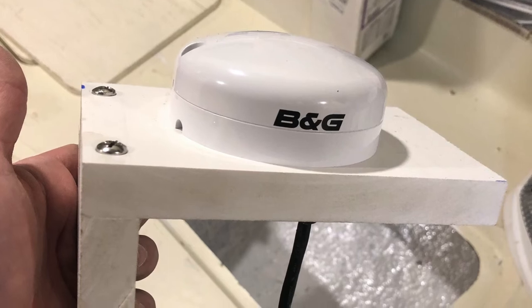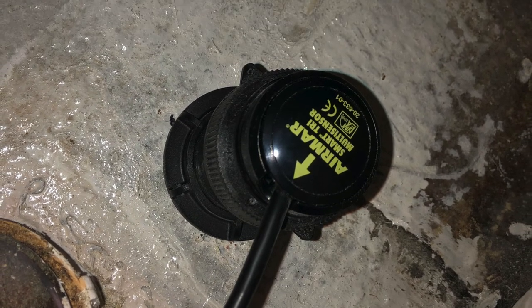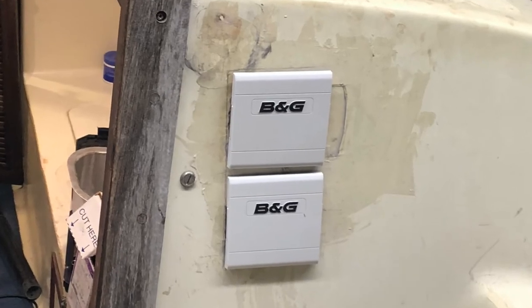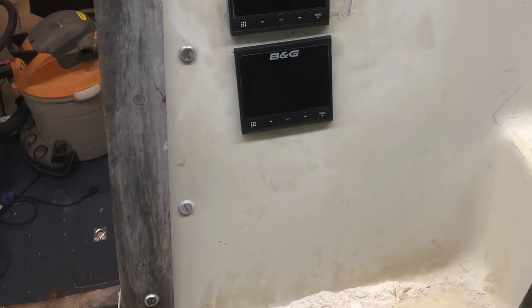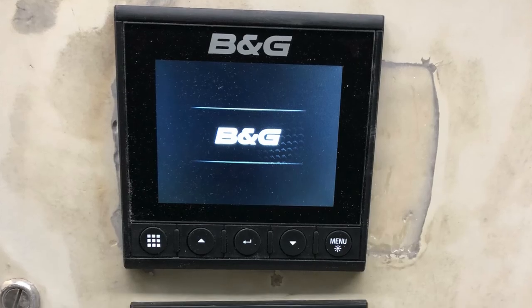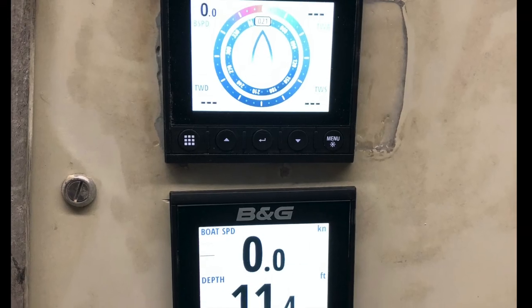Dennis made a mount for our B&G GPS puck and installed it in the center bottom of our boat in a lazarette. We also installed our B&G multi-sensor through our hull to track our speed over ground and depth. The exciting project was the B&G displays. We went with the Triton 2 kit. It came complete with everything we needed for wind, speed of our boat, location, and direction, as well as 2 display screens. We did a lot of research and chose B&G because the screens are crisp, modern-looking, and very bright with minimal energy usage.